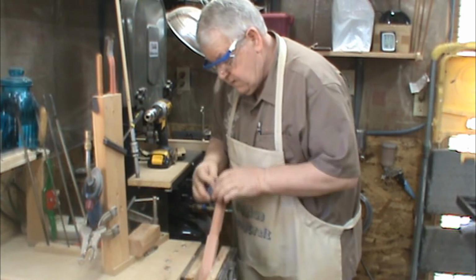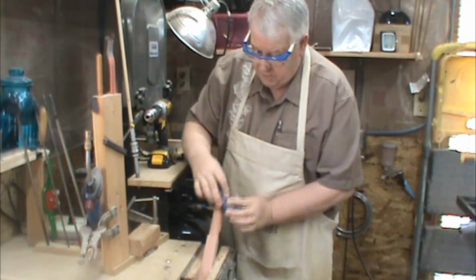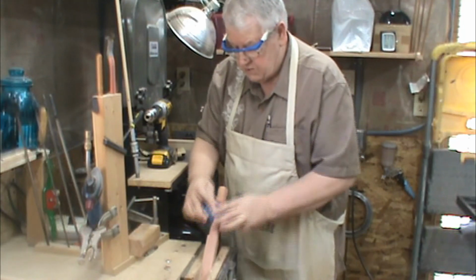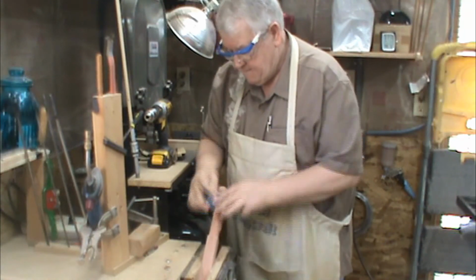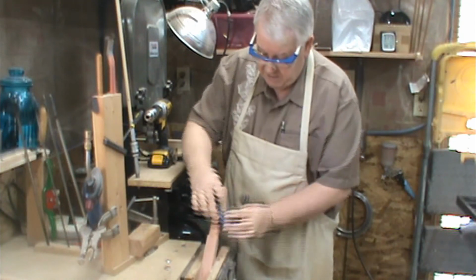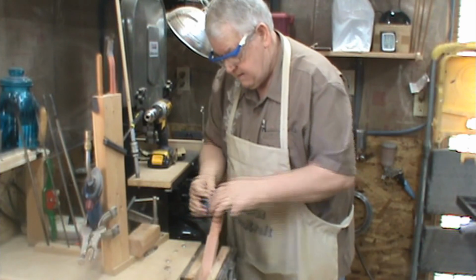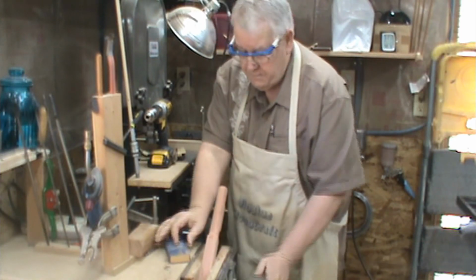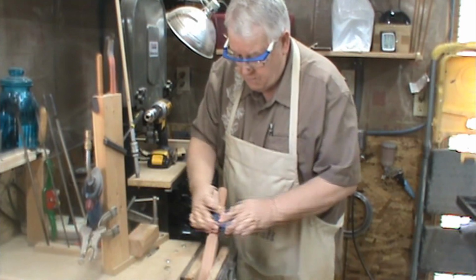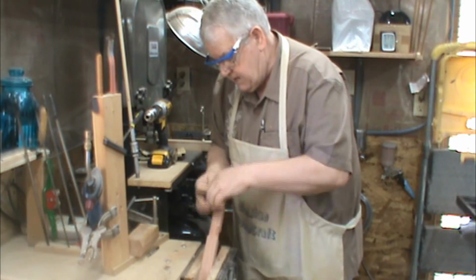Don't put your piece in and turn that vise too tight. You will crack your seam, and you've got to start all over. Somebody want to ask me how I know? That's right. Beautiful. Yeah, just about done, and we'll take it back over and finish up the lathe turn.